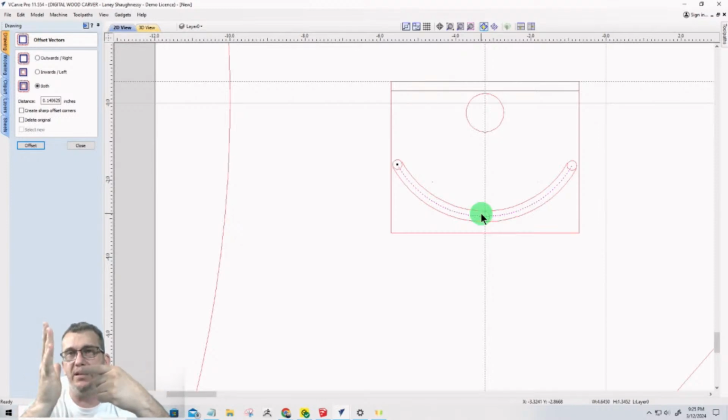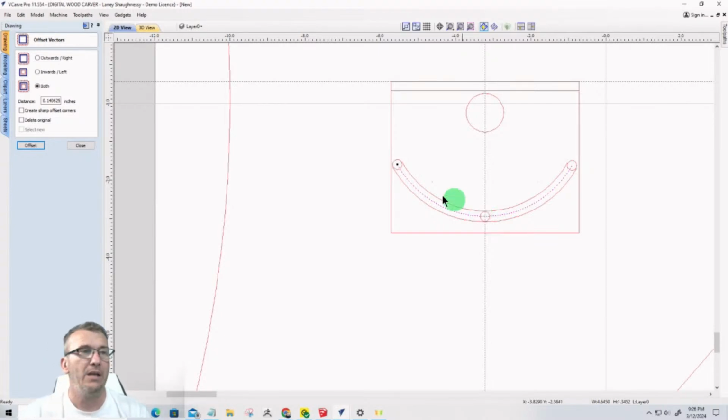I want one bolt going into my threaded insert on my dowel. When my plate pivots, I want to be able to tighten it down or loosen it, and swivel that plate anywhere that I need. I don't want to be limited to just going into holes, where I can't get it tilted perfectly the way I want it. But yes, JR, you can absolutely do that.